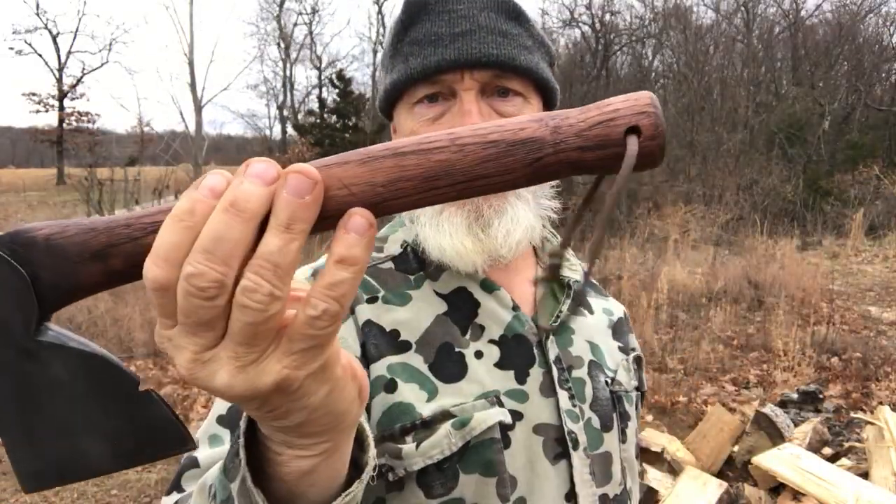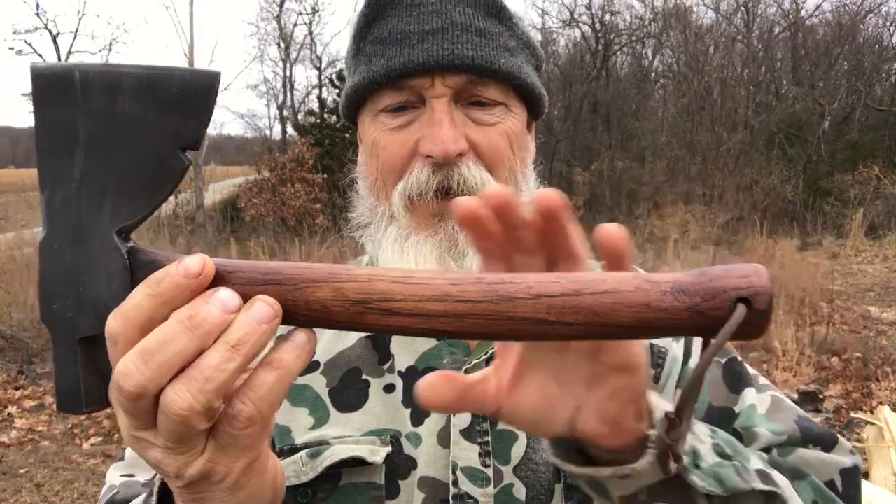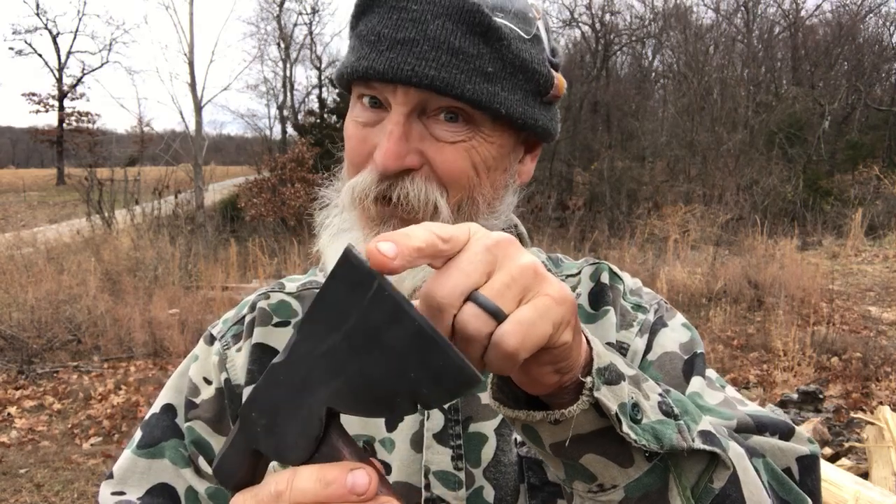After the vinegar treatment, you can see what I did to the handle — contoured differently. I drilled a hole and stained it. So this is now one of my bushcraft axes. It's a lot lighter in the hand and feels better with the thinner handle. I think it looks pretty cool. The stain isn't quite dry yet — I'm going to let it dry for a couple more days since it's cold. Then I'll put some boiled linseed oil on it, and sharpen the blade, which already comes pretty sharp.